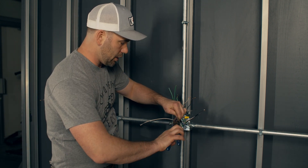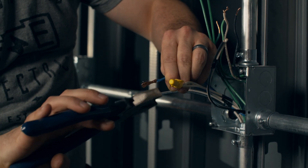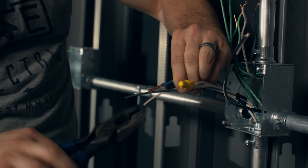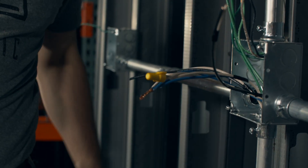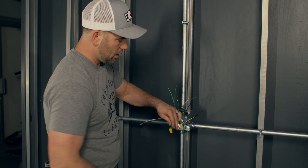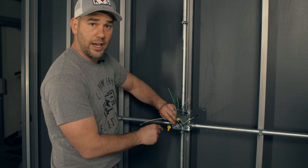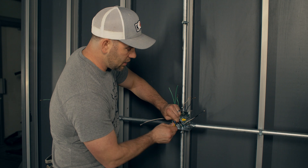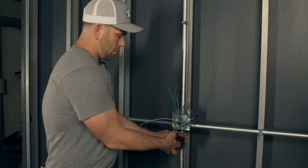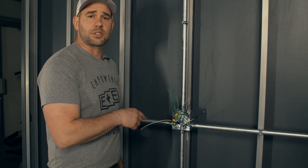Watch this blue wire — I'm going to show you something. When you twist it, see how it gets all finagled like crazy? I hate stranded wire so much. We actually don't use stranded wire for almost anything. Now I want to show you what NOT to do. With all this extra copper sticking out, I put the wire nut on and twist it — it gets snug and tight. I've opened many boxes and seen that. I'm going to tell you right now, that is a fire hazard, a short hazard, a shock hazard. And I've even seen people just wrap tape around it to hide the exposed copper — that's a hack job. Don't do that.